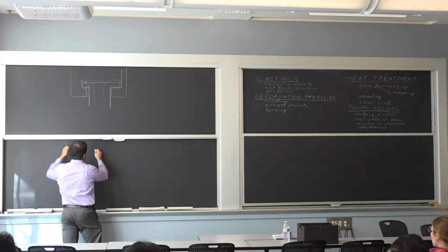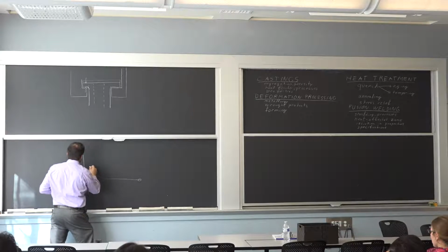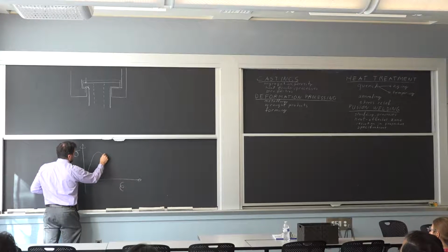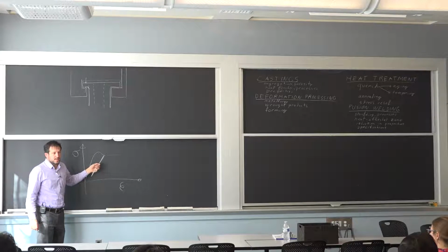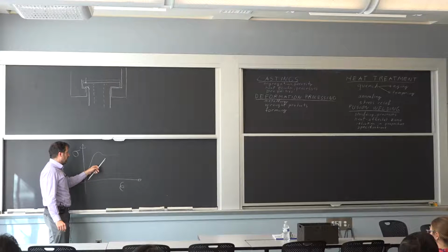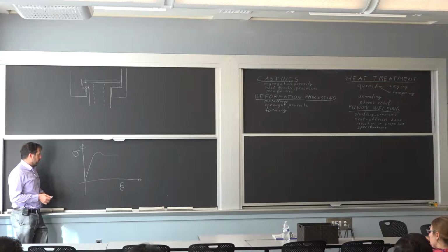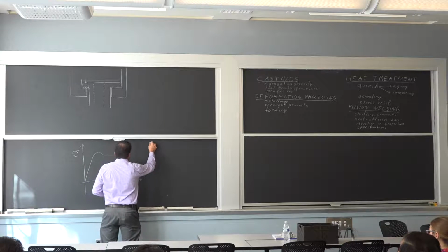So when we refer back to our stress strain curve, what we discussed at high temperature is that we have our stress or deformation, and it essentially goes to a certain transient regime, and then eventually it's a constant stress. That's our forming condition. It's perfect for rolling because you have a competition. You keep recrystallizing grain, you have a lot of recovery of dislocations, so you get into this steady state. When you do it at cold temperature,